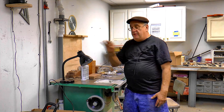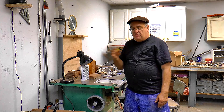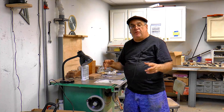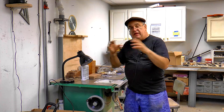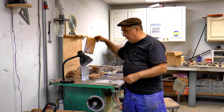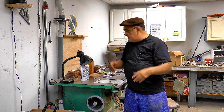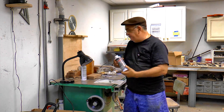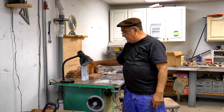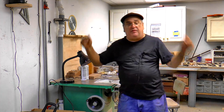Then I'm going to take a developer and put it on there — six parts water to one part of the chemical. You put it on there and it kind of washes it, and it'll take all the green stuff off — you'll see it's green. It'll leave the lettering. When it leaves the lettering, I put it in the acid in this tank right here. That will etch the stuff out with this etching solution — ferric chloride — that I bought at Radio Shack. I had the developer and just needed the etchant. So let me get that set up and we'll get back to it.